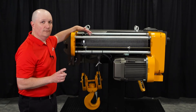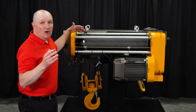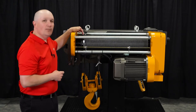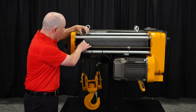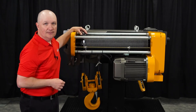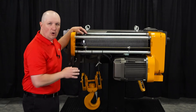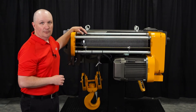One thing you should look for is any wire rope strands that are either broken or fraying, because that means your Rope Guide is more than likely worn as well. Also, check for excessive wear side to side and front to back on your Rope Guide. If you find any excessive wear, always check your hardware to ensure it's tight. If it is tight, you likely need to replace your Rope Guide.